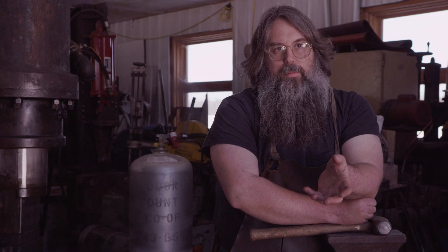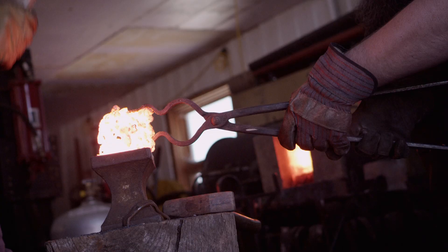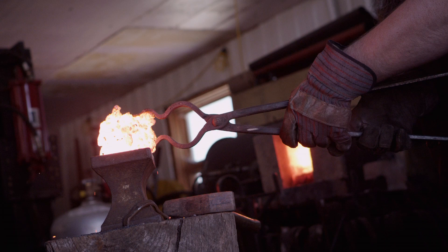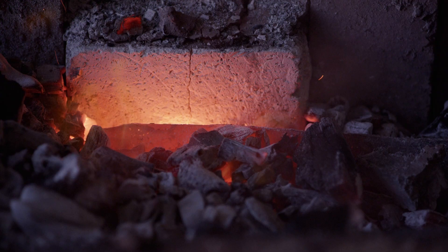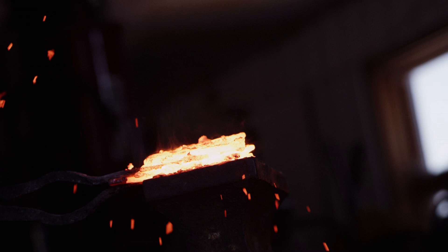It provides air to the charcoal so it burns hot. We put the bloom fragments in there. The bloom is hot and we need to consolidate it — there's a lot of wasted space in there, so we need to pull it together into a solid bar. We do that through repeated heating and forging and some forge welding, meaning we're joining the individual pieces together. In that way, they could dictate where the cutting edge steel was, picking the best material right out on the cutting edge.